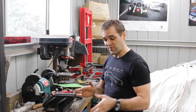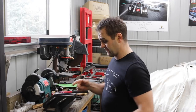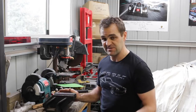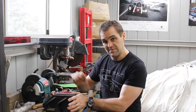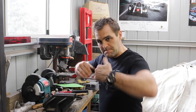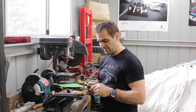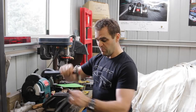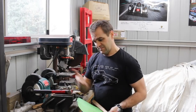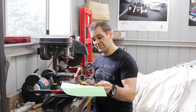I actually find the bench vise quite handy for a lot of reasons. Sometimes I just use it like an anvil - there are lots of curved surfaces and sharp corners I might use, and I'll hammer the metal over whatever corner or shape I need to make my custom piece. Another little trick I picked up is if I have a ball peen hammer, I can lock the hammer in the vise, so I've got a nice round head there in the vise, and I can just stick my sheet over the top and shape it accordingly.